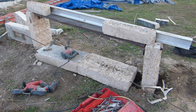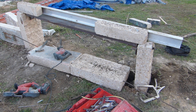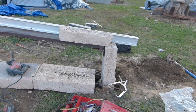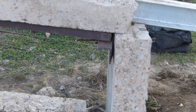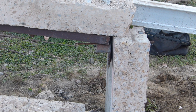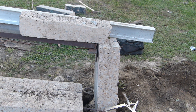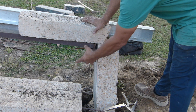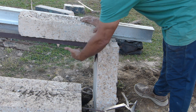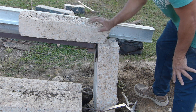Hopefully you guys can conceive the concept. It's the ledger system that I really want you to understand — it now doesn't care about whether you have heads or not, because this steel would be wrapped around the column, making a larger critical shear area where you pick up the loads.